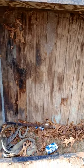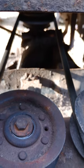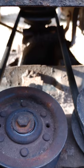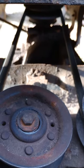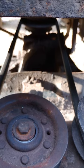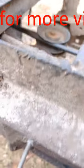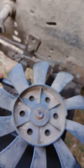I've been using this thing for 25 years. Under here, where the original hydrostatic drive was located, I tapped it out so I could put another pulley on top of it. The drive pulley going from the engine to the first hydro is the same, but I added an extra pulley — a larger pulley — to give it a little more top speed. I added these two pulleys here; they act as idler pulleys. There's an adjustment screw here so you can tighten this belt up, and then it goes to the hydro that actually has the wheels on it.